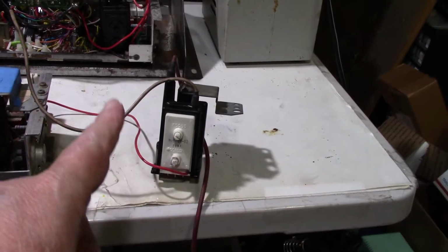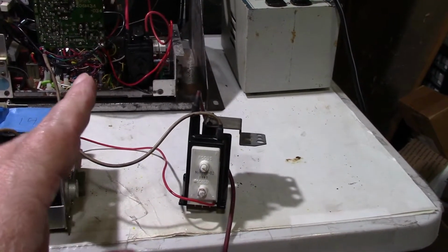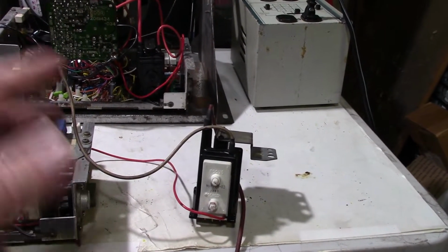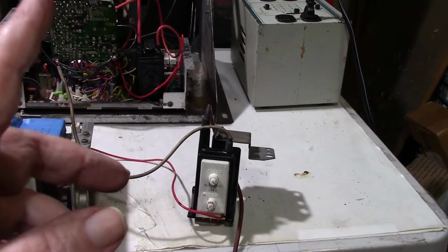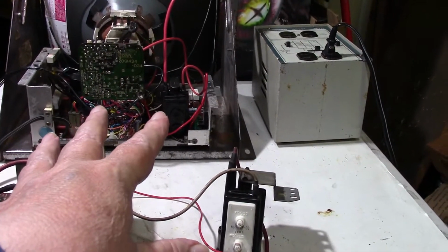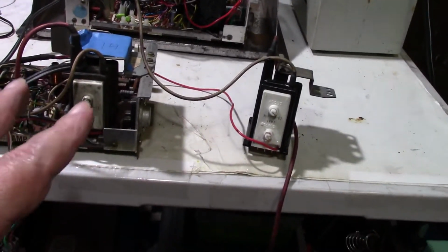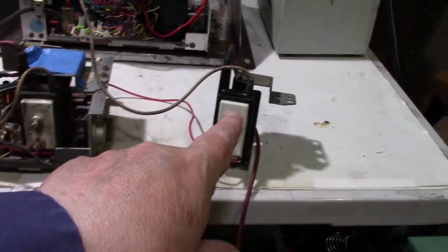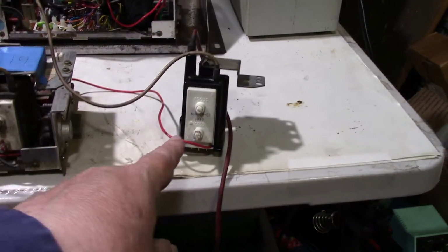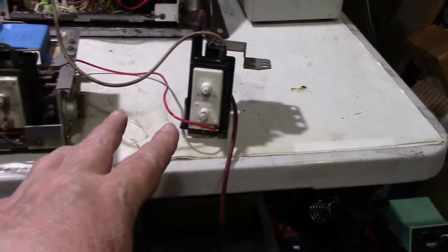What I also can do, I do have a working 4900 in a game. It needs a cap kit, or could use a cap kit. So I may pull that chassis out, pull the working Flyback off of that chassis, and put this on it, just to make double sure. But it's starting to look like the Flybacks are different. It has a different number. The focus screen block has a different number.